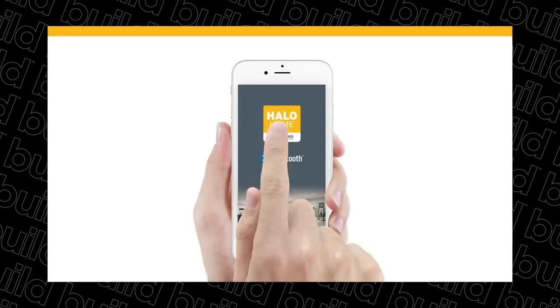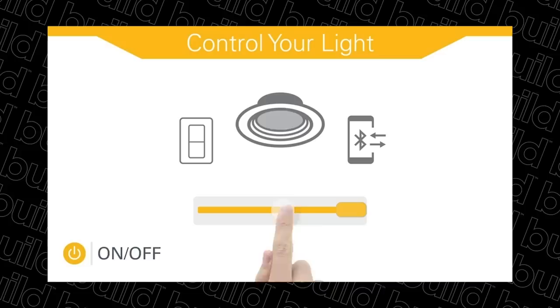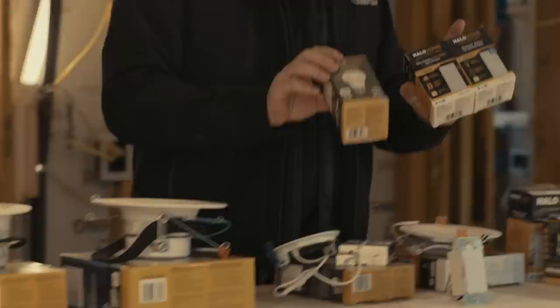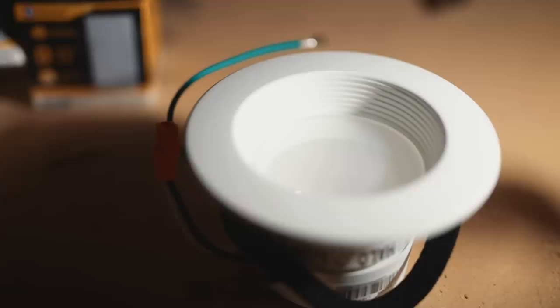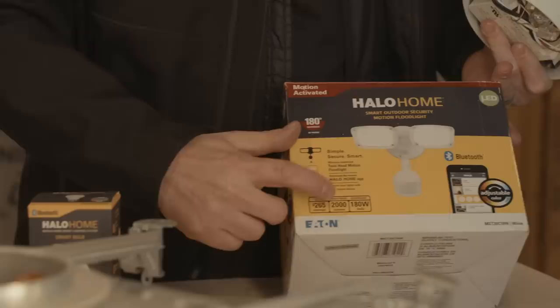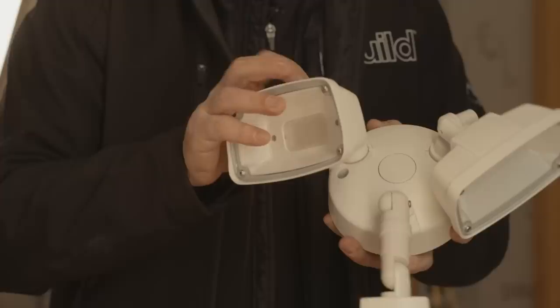Pretty much all of these products except for one are Bluetooth enabled, and they've got a fantastic app for your phone that you're going to bring each one of these devices into so that you can control that device. We can control things like color temperature and vary from really warm to really cool daylight temperatures. We can also control the dimming. They have two different things we can do — we can either control that at the switch, which is what this keypad is, or we can control it actually at the fixture. They're Bluetooth, which means they're communicating directly to your phone. It's not using your Wi-Fi network. We don't need the cable guy to hook up the network to set this up. We can all do it from our phone and they're mesh enabled, meaning they talk to each other, so these devices are ping-ponging the signal so that from here, even though my security lights might be 75 feet away on the other side of the house, these devices will talk to each other and I can control this one even though we're using Bluetooth.